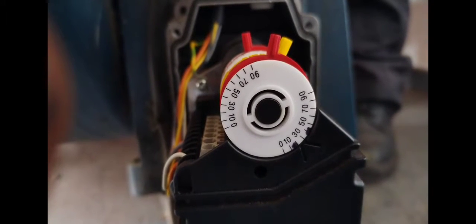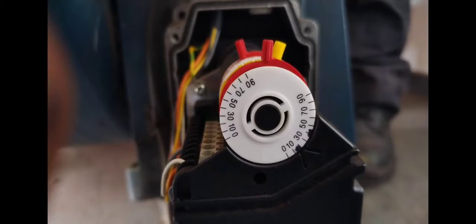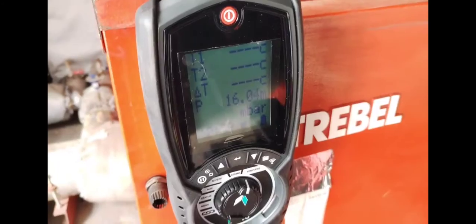This is it going back to low fire because I've got it at 10 on my cam. Looking from underneath you can see it moving from 10 to 30. To allow more air — as more air is let in for high fire, more gas should be going in as well. There should be a good balance between the two; they follow one another.